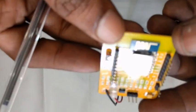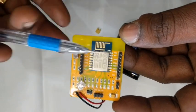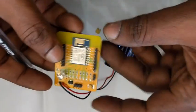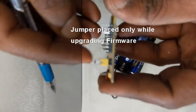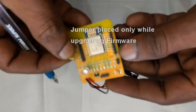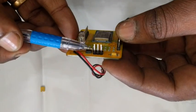This Wi-Fi board is built on the ESP8266-12 version of IC. All the GPIO pins are extended with berg pins to enable external connections. A LO jumper is provided to pull GPIO0 pin to ground, which is used only while upgrading the firmware. During normal operation this jumper must be removed. There is a 3.3V regulator on board, and RXTX and ground pins are extended to enable serial communication.